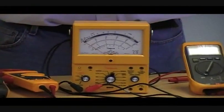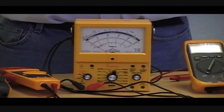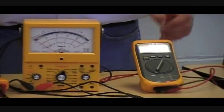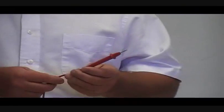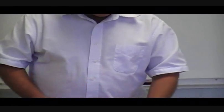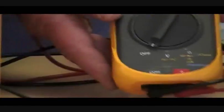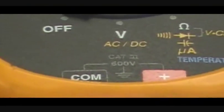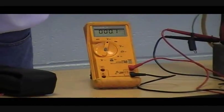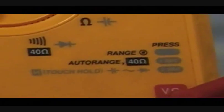Keep in mind the leads are important too. If you have a CAT 3 meter, your leads also need to at least meet CAT 3 requirements. If you have leads that have become broken or maybe have a loose connection somewhere inside, throw them away — destroy them and buy some new leads. Your life is depending on it. I cannot overemphasize that. I have an older meter that does not have a CAT rating, and that's all right. It's older and doesn't have the CAT rating, but it's still a very, very good meter. Just make sure that its rating is sufficient for what you're doing.